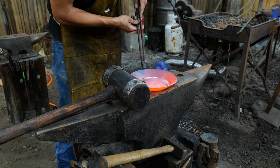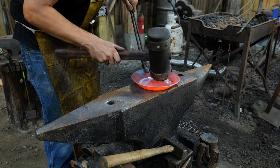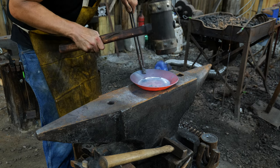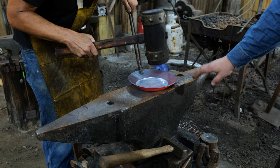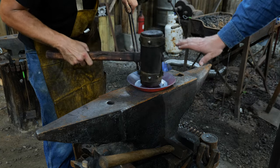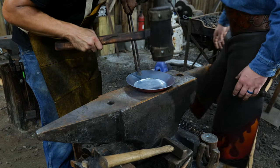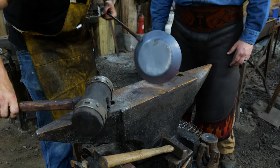For this next stage he's going to use a wooden mallet — one that he made for me — to flatten the bottom, going all the way around the edge but trying to focus close to the edge. If you don't have an anvil with a nice flat top, any chunk of steel that is flat will help out in this process.